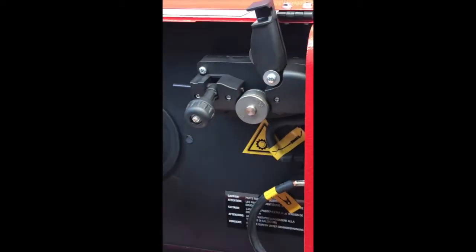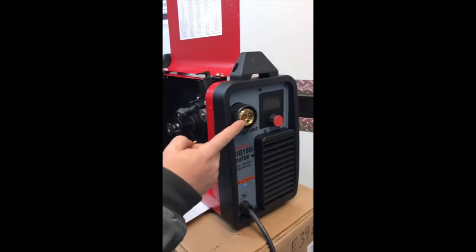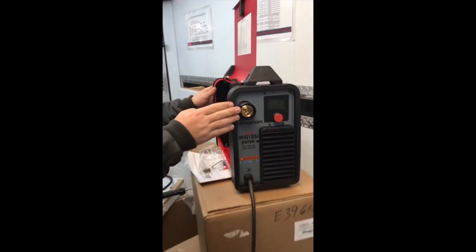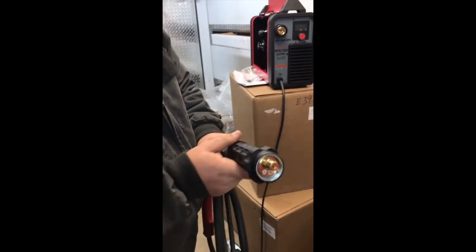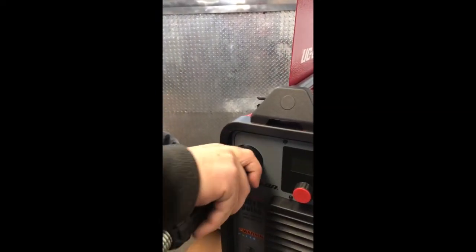Now once the roller is installed, I take my brass tube and in front of the machine right here — where that hole was, where the Teflon sleeve went in — we're just going to insert this tube and push it in as far as we can go. You don't have to worry about seating it to the right depth yet, because on our steel torch, the steel torch does not have the Teflon that the aluminum did. So we'll use this to seat it the rest of the way — line everything up, give it a push, and lock that knuckle down.